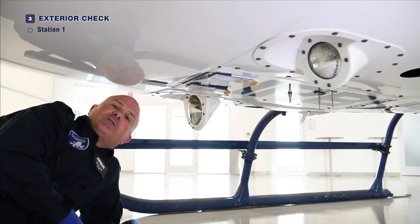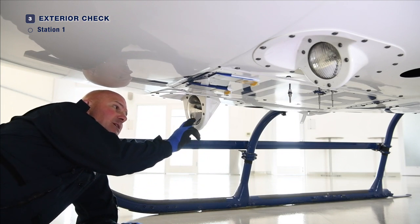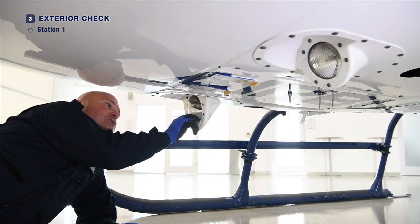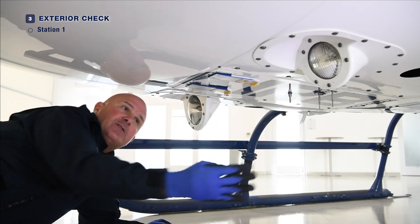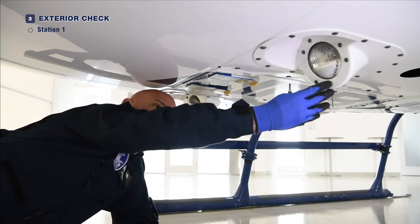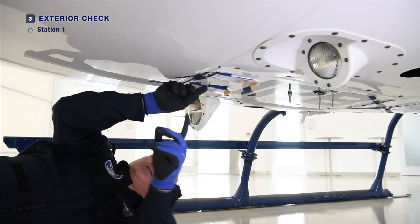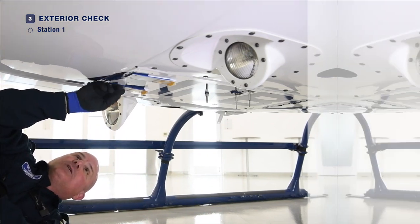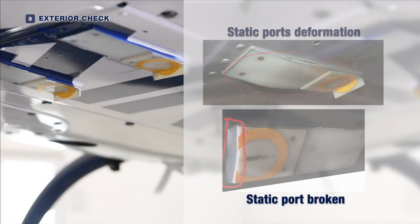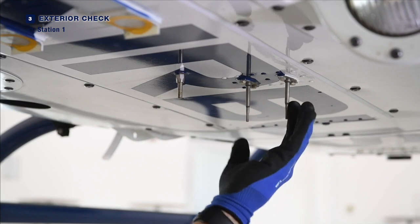In case of cold weather, remove snow and ice accumulations around the oil cooler area and on either side of the windscreen and canopy. The air inlet must not be obstructed. Ensure that the rod which holds the wool string for the side slip indicator is removed from the stowed position and the wool string is in good condition. Also ensure the pitot tube cover is removed, the pitot tube itself is firm and stable with no cracks, and the hole is not obstructed with snow, ice, or other debris. Now let's check items on the belly of the aircraft — ensure the landing light is secure, the lens is clear, clean, and undamaged. The same for the taxi light. We can also check the two static ports to make sure they are unobstructed and secure, and the temperature sensors to ensure they are both secure.